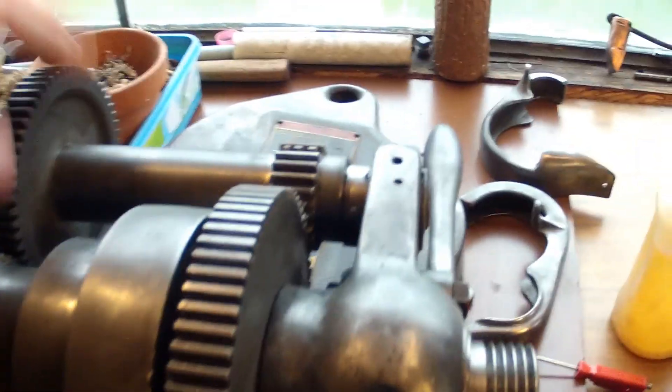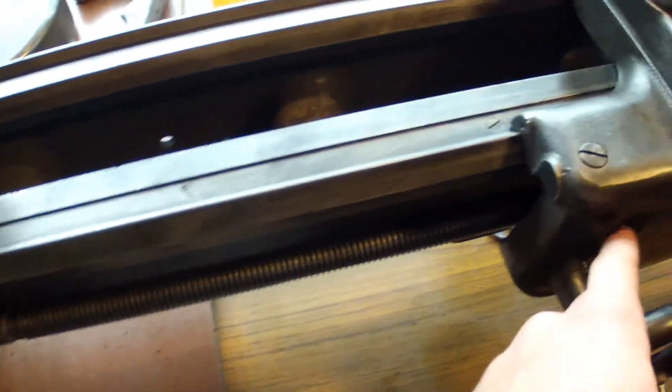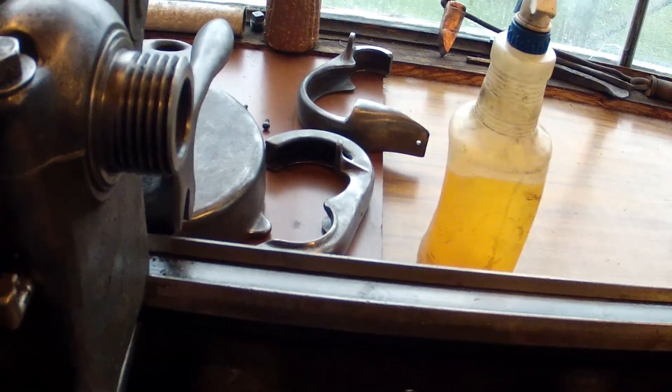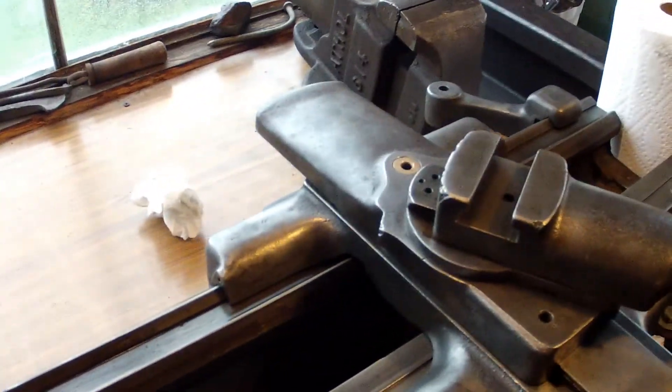You can see this would be belt driven right here, and you've got your gears for cutting threads. Down here you can engage or disengage these gears, and then this gears it down and engages into that gear, which proceeds to spin the spindle. Once the spindle is spinning, it moves the cutting bit ever so slowly towards it, cutting a groove or cutting the thread. We go ahead and disengage that.